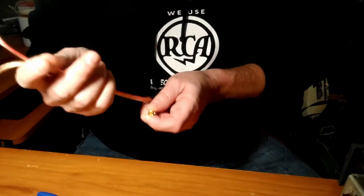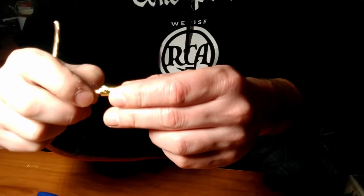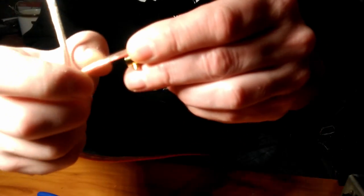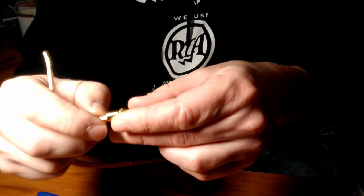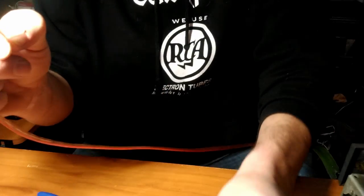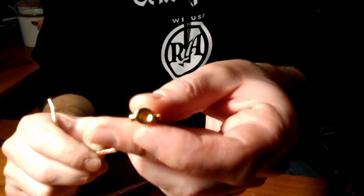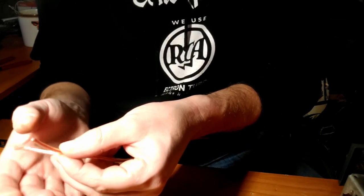All right. So before we do any cutting or stripping of insulation, we want to see how far down this sucker goes, because I can't stand a little OCD thing here. If you strip way too much and you get a bunch of bare exposed wire sticking out of the back of this, that drives me nuts. It's also important that you're not putting a set screw down on insulation. You want to be screwing down on actual wire. So it's about that big, and because there's enough room in there, we're going to fold the wire over onto itself, so we need twice that.